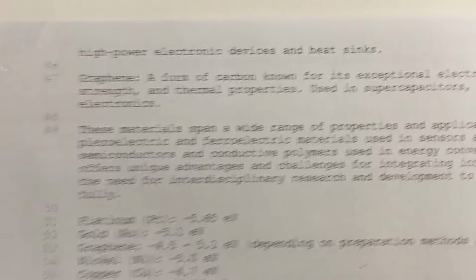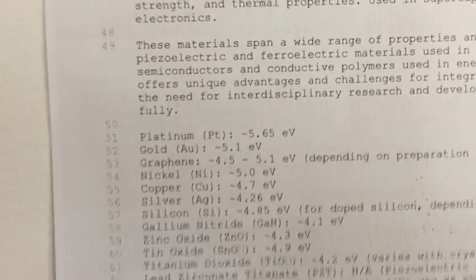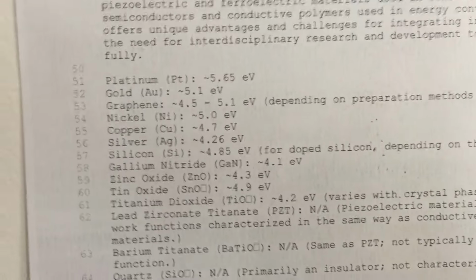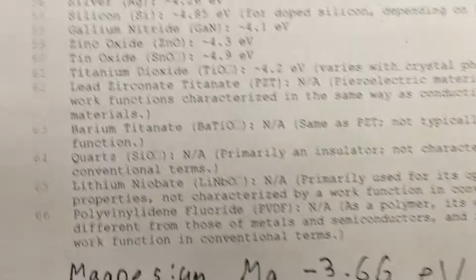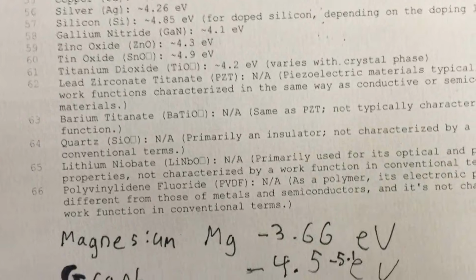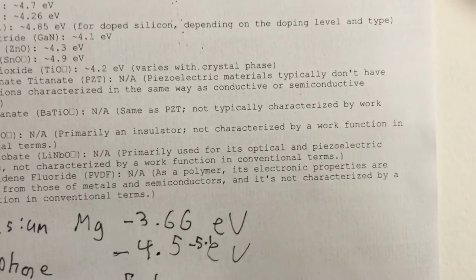Now, if we're going to build the cells with solid state, polymer and whatnot, and we're not using traditional electron flow, we've got to base ourselves on the work function unit. So here's the list in work function, because if we're not depending on traditional electron flow, we've got to look at the work function of the two dissimilars. So this gives you an idea of doing the same thing but work function based as well. And again, it all gets funky when you start getting into these exotic minerals, the titanium, the oxides, the barium, the quartz, the polymers. The game changes depending on what you're squishing in between the cell.